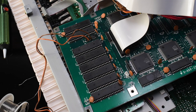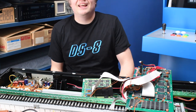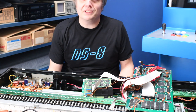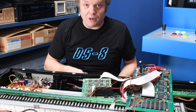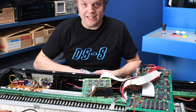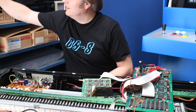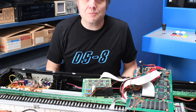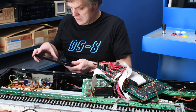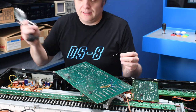So now everything is wired according to the instructions. The only thing left is to find sockets for the EEPROMs. I'm going to the shop now to get some. An hour bicycling through the city — but I still found a shop with all the electronic stuff, kind of reminds me of the 80s. Two EEPROM sockets at 1 euro 20 total. Checking the orientation, all pins are through — let's solder them in.